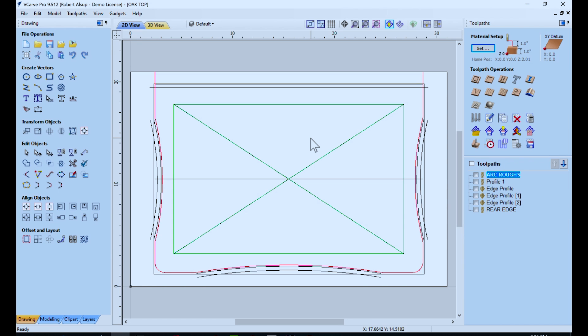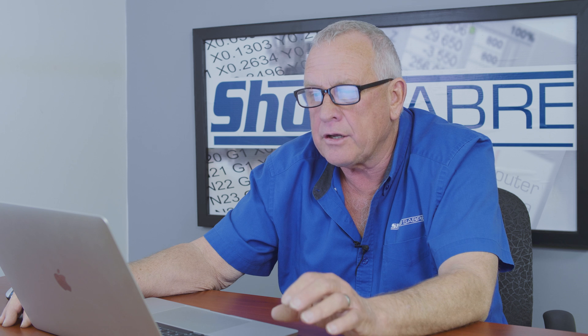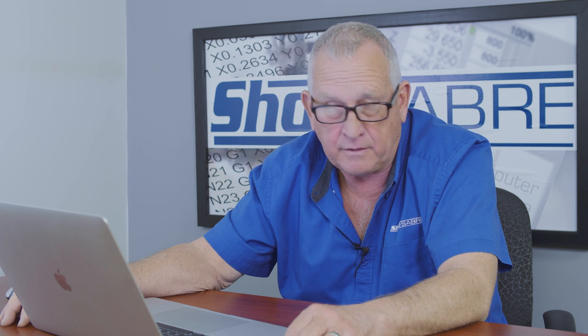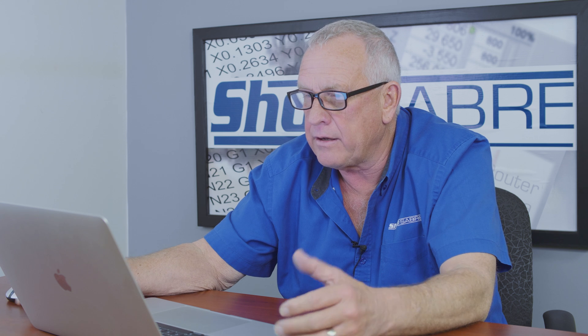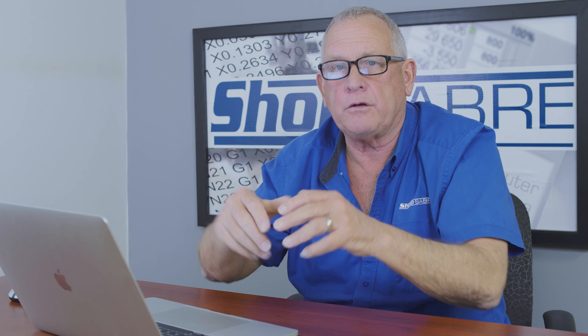What you see on the screen is the geometry required to machine this. We've got a piece of material — it's about an inch thick, it's oak, it's glued up. Now we're going to cut it out — first we're going to cut kind of an irregular shape and we're going to put an edge on it. We're actually using a three-quarter inch straight cutter, which does really well with solid wood, especially thick stuff. It's a fairly heavy cut, but that doesn't mean you need to get really aggressive on feed rates. This piece sits on six vacuum pods — there's a pod here, here, here, here, here, and here — so that's setting on six of those vacuum pods and that holds it in place.